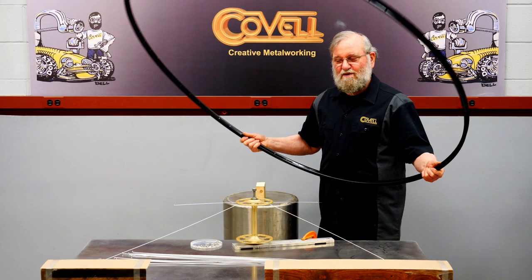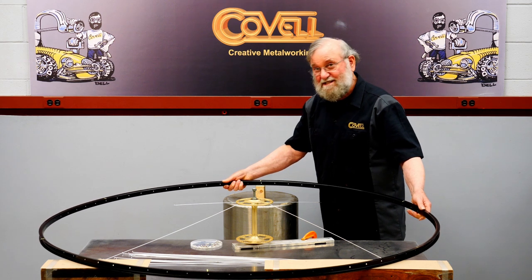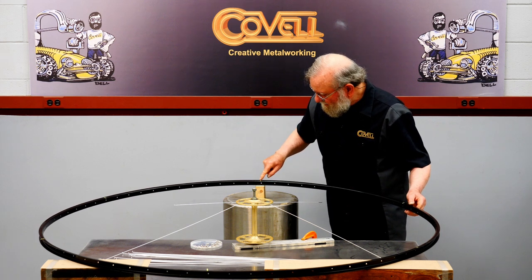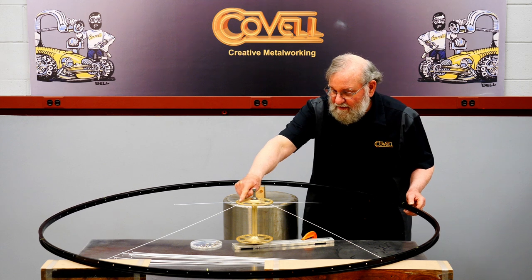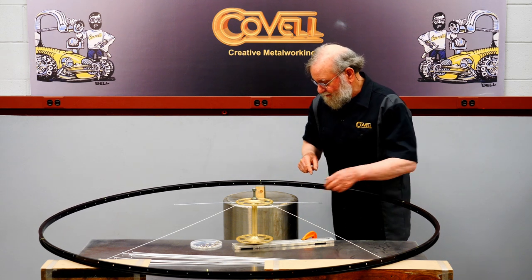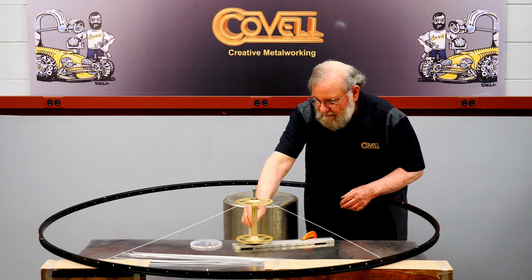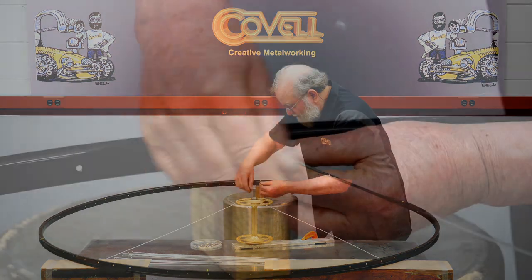It's time to put the spokes in the wheel now, and I've never done this before, so I had to invent my own system. So I mark 6 equally spaced points on the rim, and I put a piece of tape by the nearest hole, and I've also marked 6 equally spaced points on the hub, and again, I've marked those locations with tape. So I'm going to put the first spoke through one of the marked holes. I'll drop that down, and then I'll feed the end of the spoke into the hole with the tape on it.